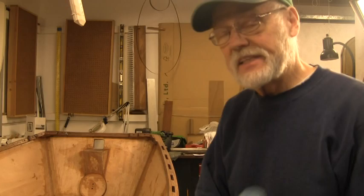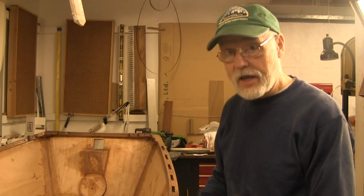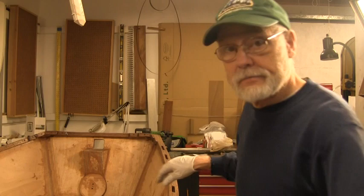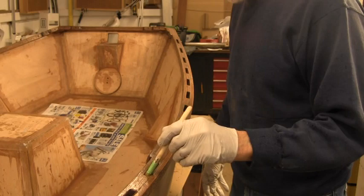Another little FYI: get rid of the dusting cloth and get brand new cloths to touch up with. I also put a little bit of tape around the bristles on these cheap brushes to keep them from getting all fuzzed up. The finish has one coat on it now, so the wood is not going to be as porous — it's going to go farther. Watch for runs. It's going to be really critical, especially down in these little sides where you're going to get wash-out and drip and scraping from the brush on these sharp edges. Really watch your runs underneath.